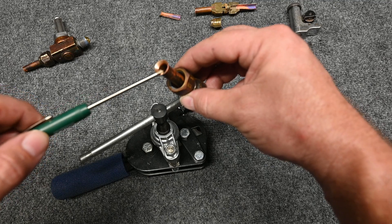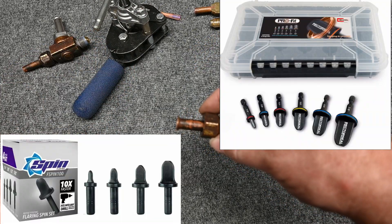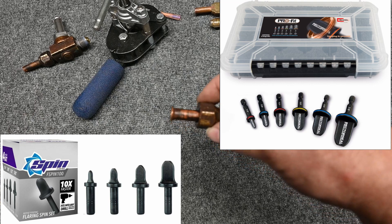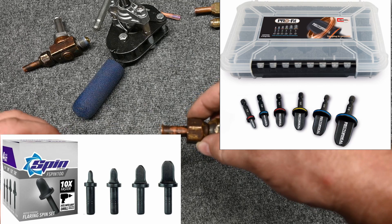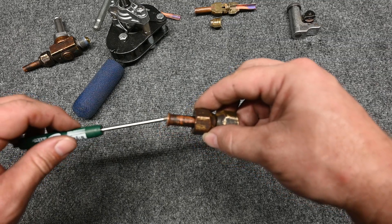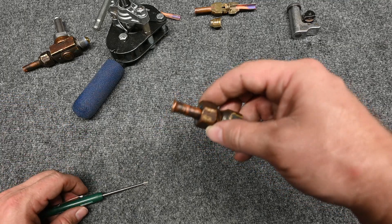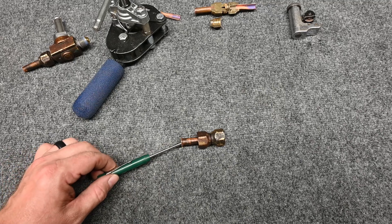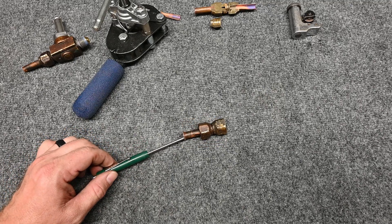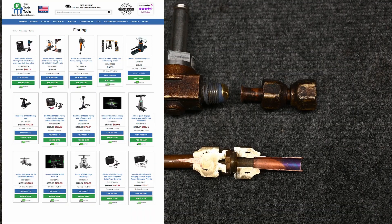There's also another type that fits on a drill. As you drill it in, it anneals the copper — gets the copper really hot, makes the copper soft — so it's not leaving any hard edges or cracks. They say that one has really good benefits. But the key is: learn how to do the flare. Practice it. Learn how to make good flares, practice cutting them off, and use the Nylog. Whichever tool you use, whichever method you work — practice it and perfect it.